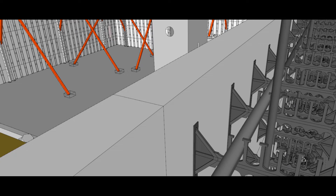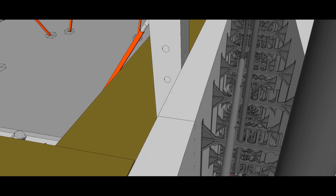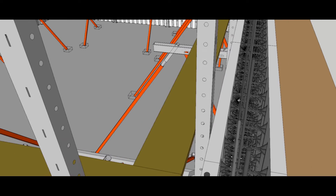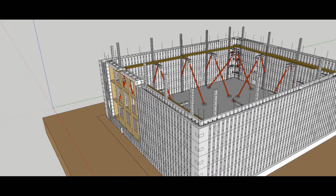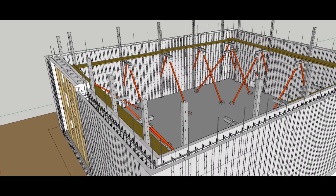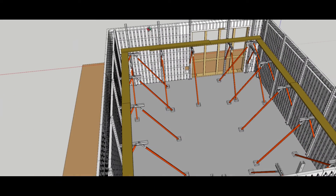You can see the steel going right between the other bars for strength, giving you the easiest opportunity to set it. We've only got one more course of block to go — and there's our top course. Now we're getting our rod started, placing the rod work off our plank.